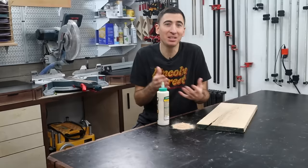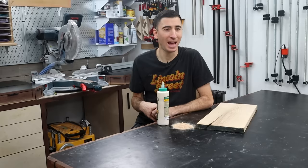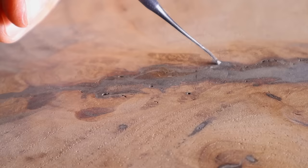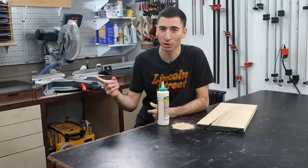There is no doubt you can fill those spots with the wood glue and sawdust trick and they'll likely look great right after sanding. However, what's often glossed over when people demonstrate this online is what the repair looks like once a finish is applied. On large gaps that are in plain sight, I would stay away from this technique. Instead of trying to hide your mistake, you can use CA glue or epoxy, which will stand out, but it's going to look more like a natural crack in the wood. I would apply the same logic to knot holes or voids — sometimes it's better to accentuate than to try and cover something up.